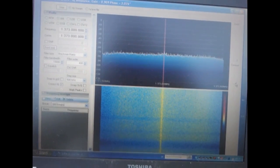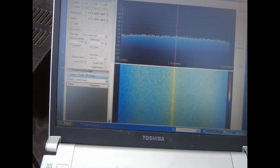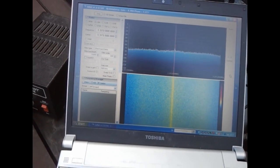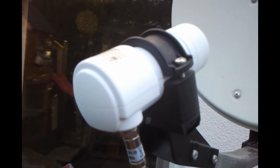The FFT has increased the noise floor. We can't see any actual discrete signal because this is a very wide band phase shift keyed digital satellite signal. So the noise that we are seeing is the actual signal — no question.